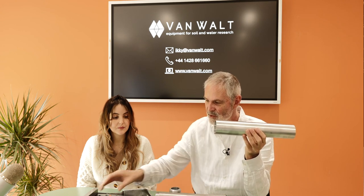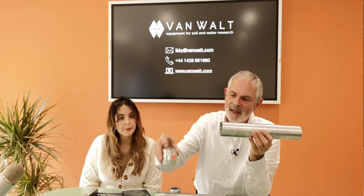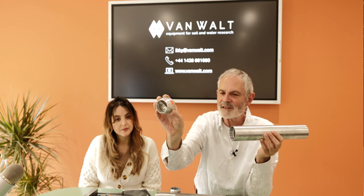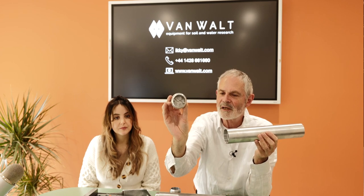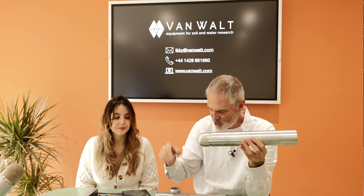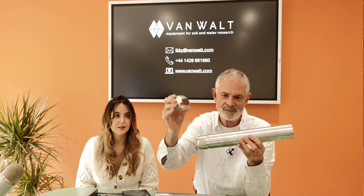Alternatively we can use a completely different type of head which is actually part of the set. We call this a butterfly valve. You can see it in its open position here, but if I close it the butterfly valve closes. So you have really good sample retention. It's very straightforward — liner inside, put your cutting shoe of choice, and generally it'll be the open shoe which has no restriction at all.